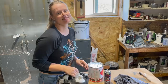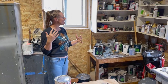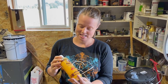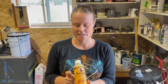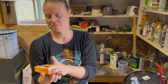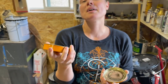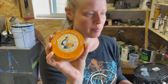I use a Rotex for that polishing process. I also have a product I found out about from Thomas Johnson — it's great for giving something an extra polish or a nice low-luster sheen, or just cleaning up a piece you're not refinishing. It smells wonderful too. And my absolute favorite is a salad bowl surface finish — I love putting it on the inside of drawers. It's antibacterial and smells like oranges. When you have a stinky drawer and finish it over with this, it smells amazing. It does dry, so it won't leave clothes waxy.